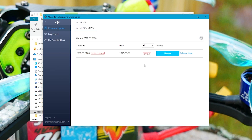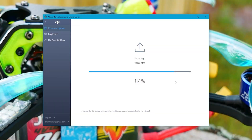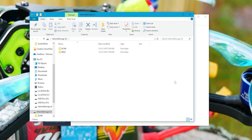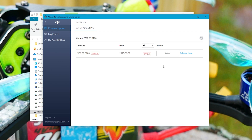I am not on the latest firmware, so I need to go ahead and upgrade. Click 'Start Update' and now we are going to update our firmware. First, plug in your LiPo and power up your air unit — it will power through the quadcopter. Then plug in your Type-C and that will connect you to the DJI Assistant app, which will recognize it as a new air unit that needs activation. Once that happens, you can move through the process of updating firmware. Once done, it'll show that the update is complete. Press back, and as you can see it's telling me my current firmware is the official firmware — it no longer says 'update,' it now says 'refresh.'